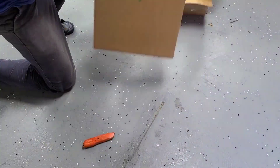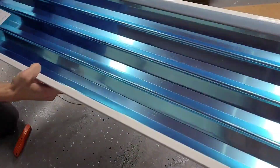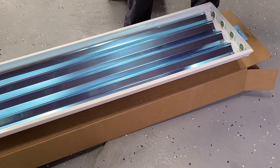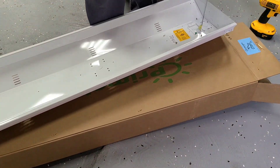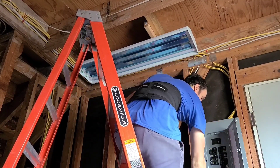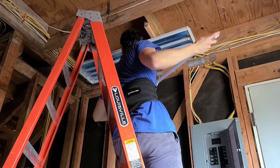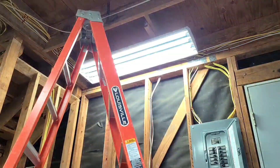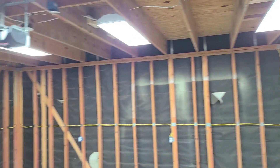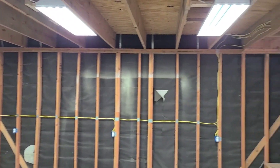This shot is more like an unboxing so you know what to expect when you order your lights. Take out the aluminum reflector — it's attached with two screws on one side and two tabs on the other, then it lifts right out with the wire. The LED lights have internal drivers, so you don't have to worry about external drivers or ballasts. This is a one-time buy with no maintenance: hook up the electric, install the lights, flip on the switch, and these things will be good for 50,000 hours. It's hard to put into words going from a single light bulb in the shop to 28 LEDs.